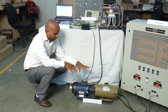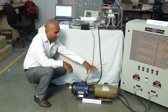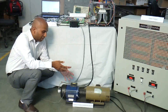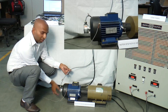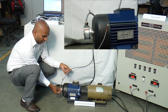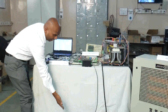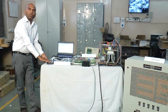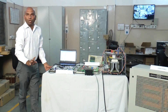We have coupled the AC motor with the DC generator and can apply load through the load panel. We are also measuring the speed of this induction motor using a 5V encoder interfaced to the motor. The encoder pulses are given to the sensor panel and then to the DSP kit, so that we can measure the motor speed using the encoder.